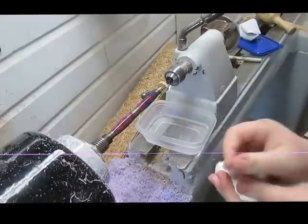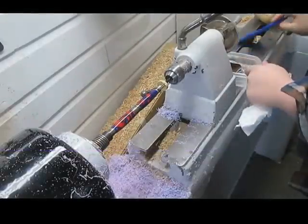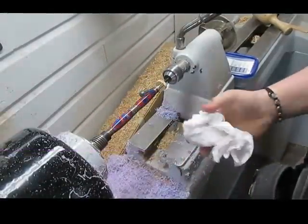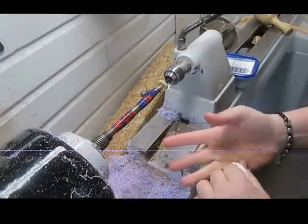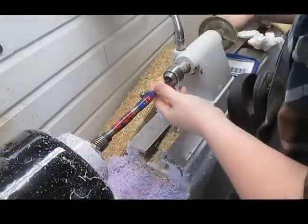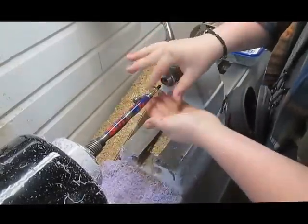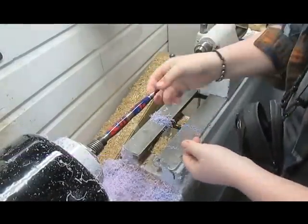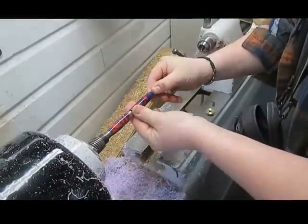The micro mesh — I've never used this stuff before now, and that just puts such a nice shine on there. It is so smooth to the touch. Just buff it up with a paper towel every now and then and I think the shine will stay there just fine. That looks like there's a finish on there. Now I'm just going to take it off my mandrel and start assembling it. There are a lot of little parts and steps in assembling the cigar pen, so I'm not going to film that, but if you print off your instructions from Woodcraft, it will have all the details.